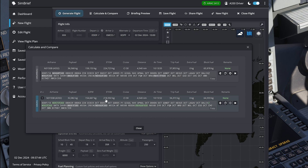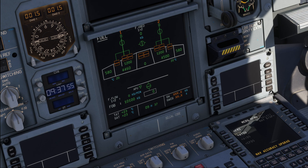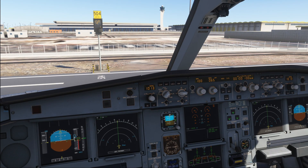This leaves us a lot of additional weight — around 15 tons — to take additional fuel. This means the A330-200 has a vastly increased payload or range capability under maximum payload, and therefore an installation of a center tank totally makes sense. The center tank in the 200 is capable of carrying an additional 32.5 tons, bringing the total maximum fuel quantity up to 109.2 tons, making the aircraft capable of flying vastly further than the A330-300.